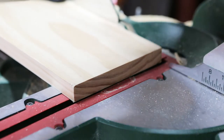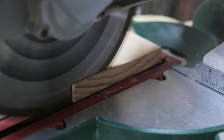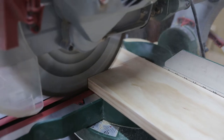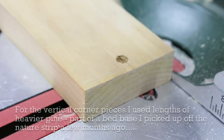First thing to do is trim up the edges of some of the boards because they always get a bit dinged. It's nice to start off with something that's a little more square than when it came out of the shop — a very quick job on the table saw or compound saw to smarten up the edges.